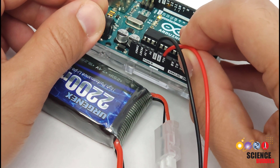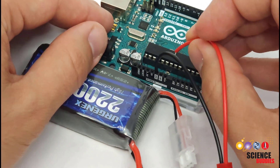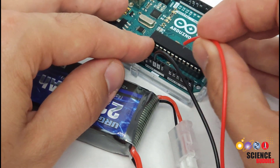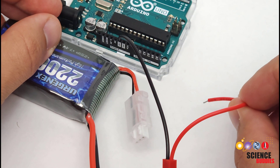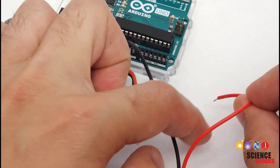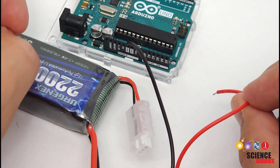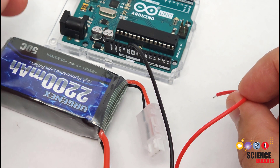You also have to think about current and how your circuit is wired if you are powering external components like motors that draw a lot of current. If you are going directly to the VIN pin, that voltage goes to the onboard voltage regulator, which will again limit you to 1 amp through the 5 volt pin. But if you have power connected elsewhere in your circuit so that the current from the motors comes directly from the battery and does not need to go through the Arduino first, then you can also connect the Arduino's VIN pin to that in parallel and power the Arduino separately — without needing to route all the motor current through the Arduino. We have additional tutorials linked in the description with the circuit diagram for that configuration.